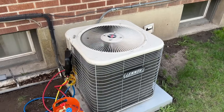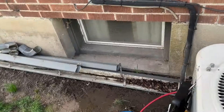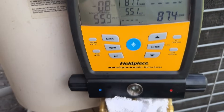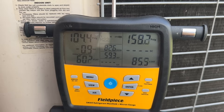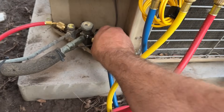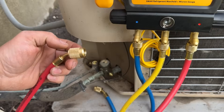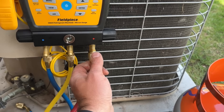Here's a tip when it comes to removing your gauges. Go ahead and flip the breaker off for the condensing unit. You'll notice the high side will start to drop and the low side will start to rise until the pressure equalizes. Then you can go ahead and disconnect your two lines — this line will be much easier to remove. If you try to take this off while it's under pressure, it'll have a lot of resistance when you unthread that fitting. Once equalized, remove the low side, then the high side. See how quick and easy that is — that is the beauty of these low-loss fittings. They're super compact and very easy to install and remove, perfect for your average DIYer or someone getting into this field.